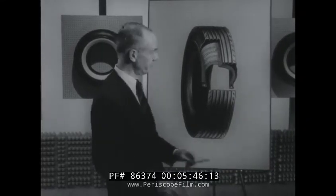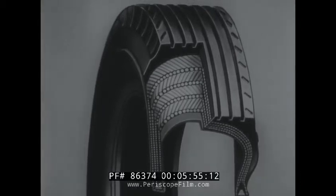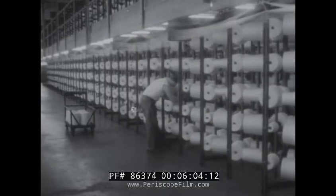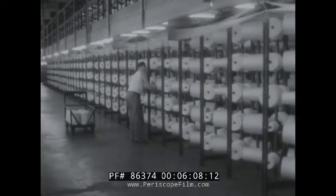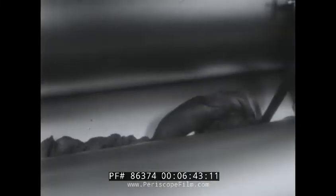Another basic part of the tire is the ply. There are four plies which form the cord body or the carcass of most passenger car tires. These cord plies give the tire the strength to absorb impacts and shocks, and to carry the load. The manufacture of ply stock starts in the creel room — a perfectly planned arrangement by which thousands of spools feed cords to a collection point, where each cord becomes part of a continuous web. The cord web then passes down to the floor below, where it goes through a latex rubber dip to increase its adhesiveness. It then travels through a series of drying rollers, which heat-set and temper the cords. As the web enters the calender to be coated with rubber, the cords are carefully checked for alignment. Under great pressure, the cord web is sandwiched between two sheets of rubber forming the ply stock.